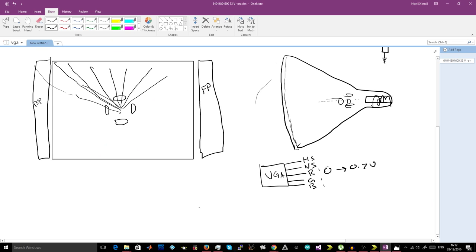Okay, one thing before starting is to know about what clock you're going to be using. For me, I'm doing a 640 by 480 display, including the extra pixels needed for the back porch, front porch, and retrace. 640 horizontal changes into 800, and the vertical changes into 525.